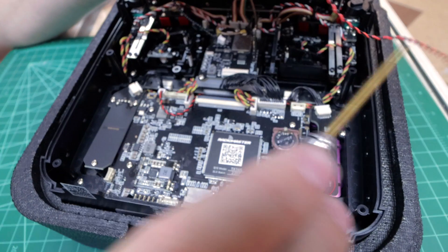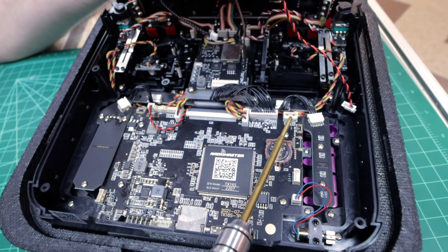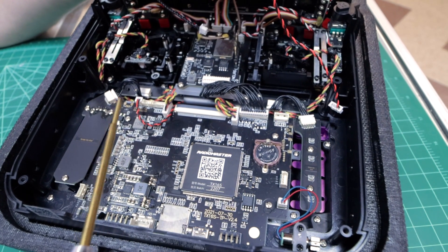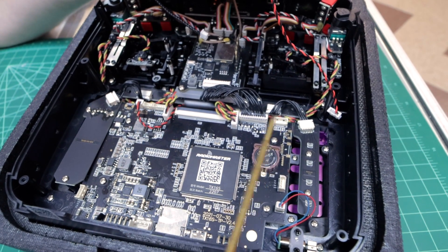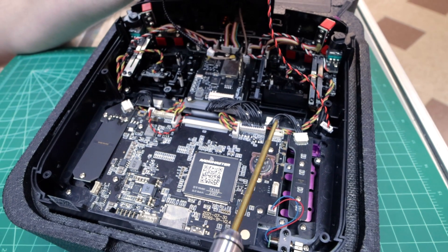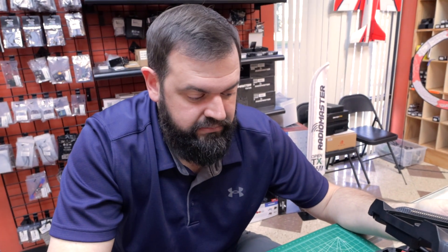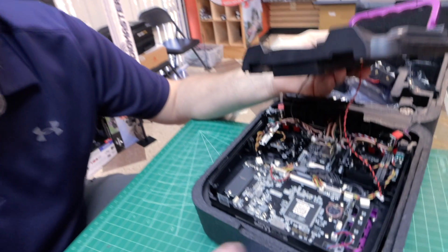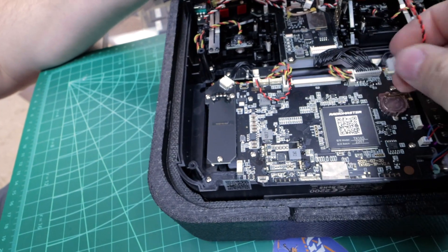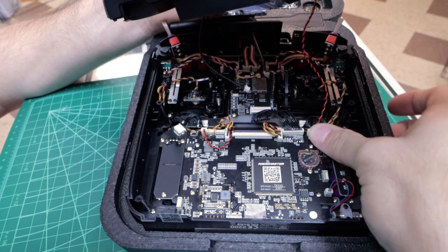So you have two places right here. You can either plug this off the switch into this plug here, or this plug here — there are actually two open ports on this radio that are unused. This one will identify as switch J, and this one will identify as switch I in the software. So it doesn't matter which one, it's just going to be on different switches. For the sake of easiness, I'm going to plug it in over here because it's just closer physically. So now this switch identifies as I.